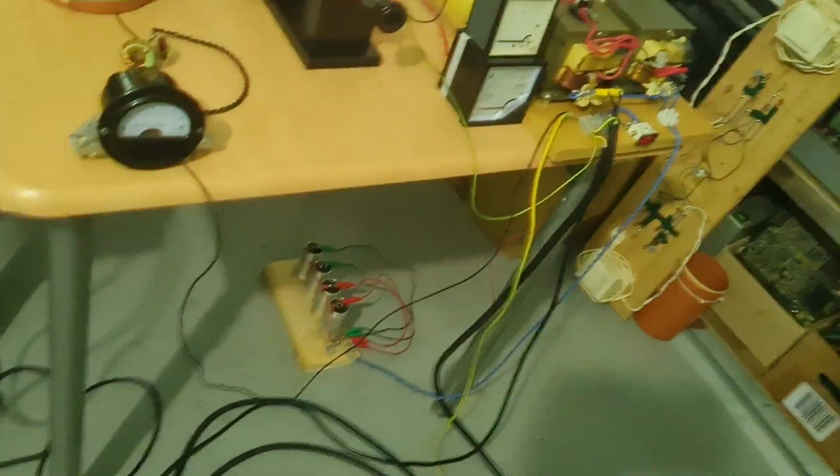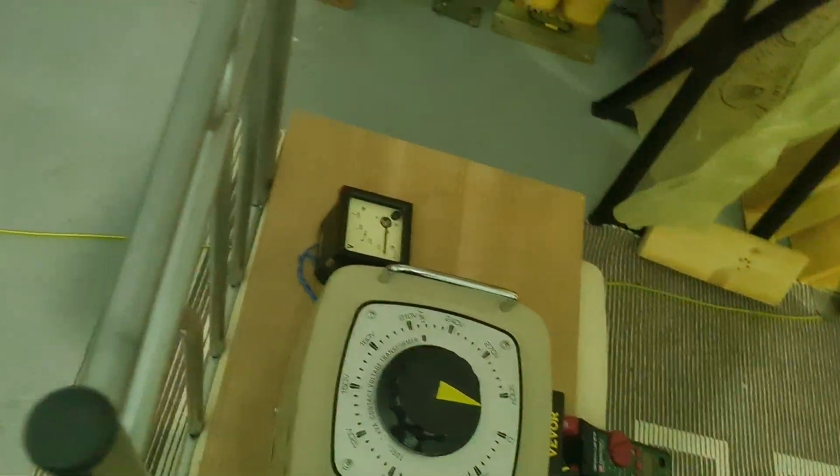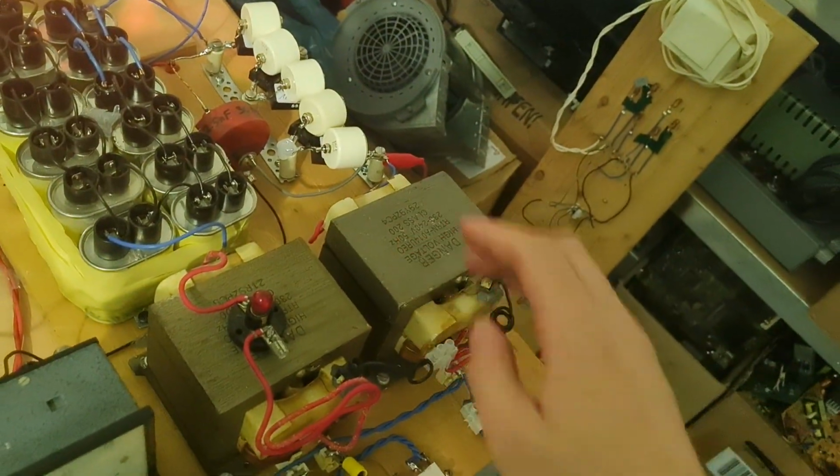All right, everything is okay, and we turn the B plus switch on. It only gives power to the variac and doesn't give full mains voltage, so this is still a kind of safety touch. All right, so we disable the lights. I have this emergency light there, so if my breaker were to trip, I would not have to be here in the dark. So I will clip my phone now into the phone holder. Okay, we're ready for testing.